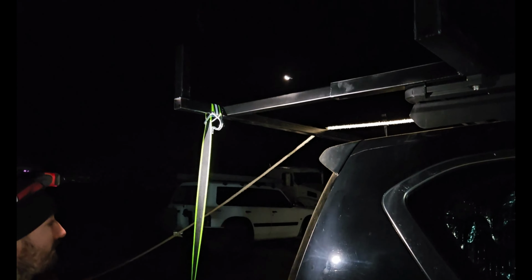But if you stay there a minute, the problem we're having is I've welded this on square with the rest of the frame, but I need to move this piece here over that way a little bit. Because at the moment, this lines up with that awning. So what happened is when we first put this up just now, the boat went up all right, but the edge of the boat come down on the awning. So all I've got to do is cut that rear frame off, move it across, and I'll make some pins up just so it does stay in there. That's about it.